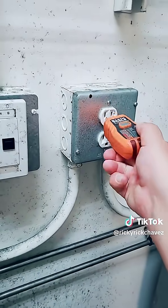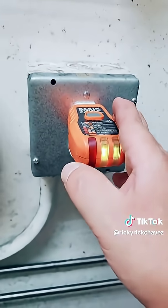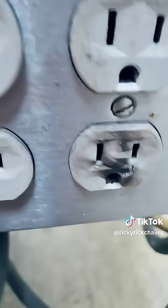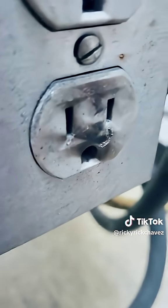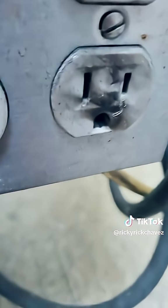So the first thing we want to do is plug in our circuit tracer, our circuit tester, and make sure that our wall socket still has power. So that tells us that the fault didn't make it back to the breaker. It was localized right here at the auxiliary receptacle unit. So after pulling out all the plugs, I can see the circuit in question. It looks like a piece of metal shrapnel got stuck in between the hot conductor and the ground.